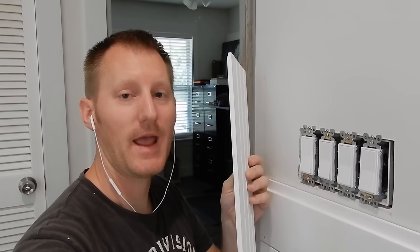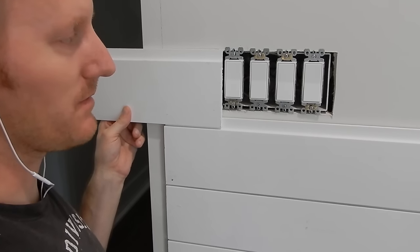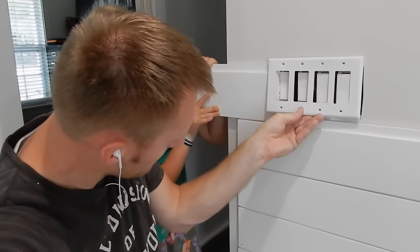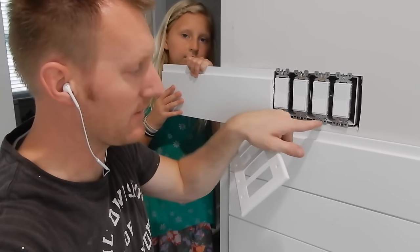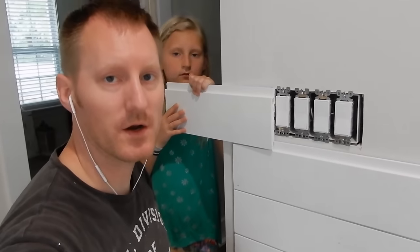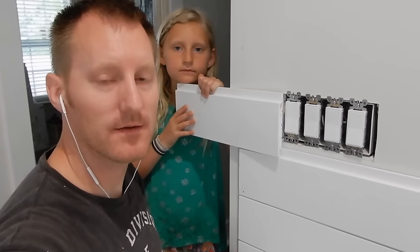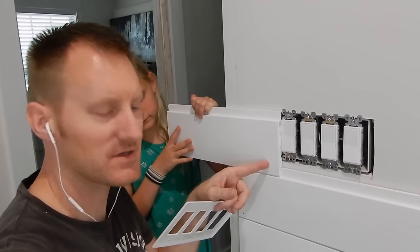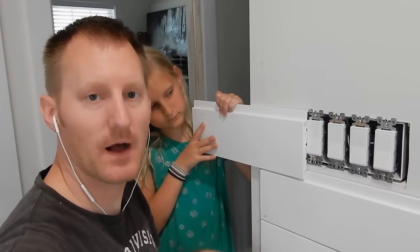Another suggestion for when you're cutting out around your light switches and outlet boxes is to get a scrap piece of wood and use it as a gauge to see where it's going to show up. That gives me an idea of where the next piece is going to come, and then I just measure accordingly to cut around it. For this piece, the light switch plate will cover pretty much down to here. You want to measure from the bottom to this line, and then measure to that line there, because you want your board to be the same size as what was cut out for the plastic box. I'll cut down from the top, then cut off — it's about an inch and an eighth to the top of the sheetrock — then cut straight down, cut over, and cut up.